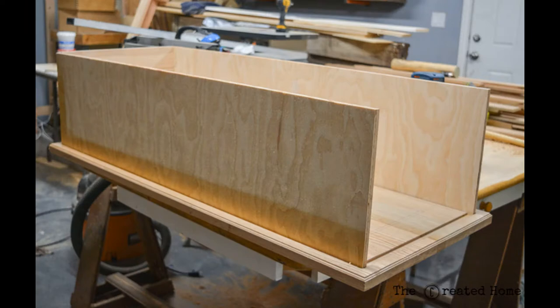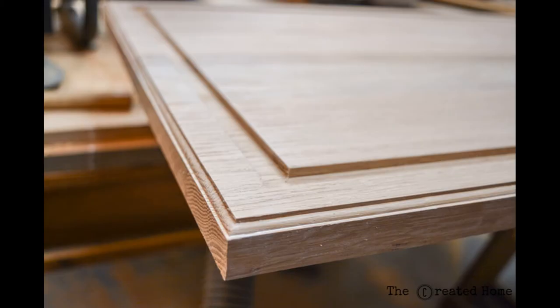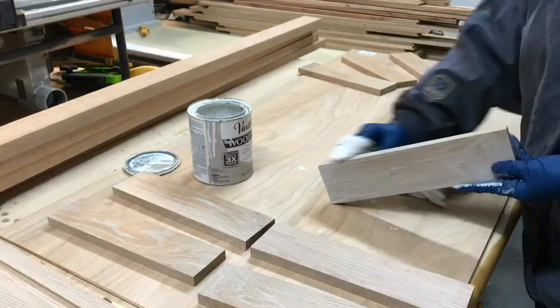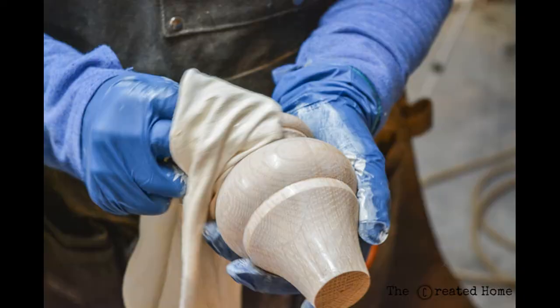The sides are formed of plywood, which I set in place by dado and grooves in the base. The side supports are also made of white oak, whitewashed with Varathane Antique White. I whitewashed everything before adding the upholstery, including these gorgeous turned feet by Osborne Wood Products. The side supports are attached via glue and brad nails.